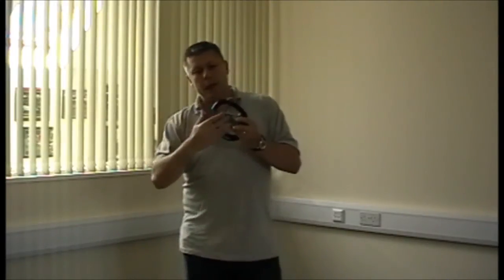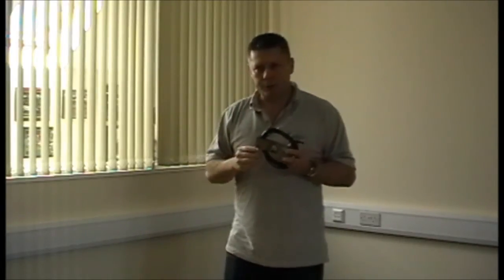And if you're weighing things like sugar or other explosive materials — say like dynamite — we can actually have them ATEX certified, which means there'll be no power or anything coming from the load cell that will spark an ignition to a flammable substance. So that's also a very good option for this particular load cell.